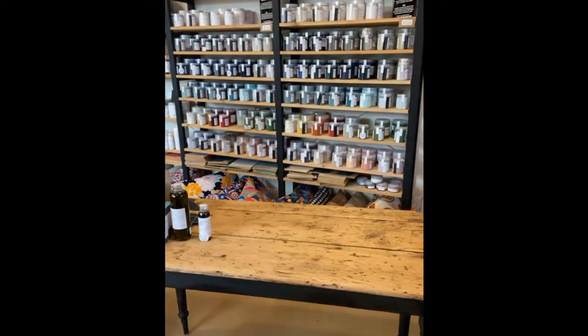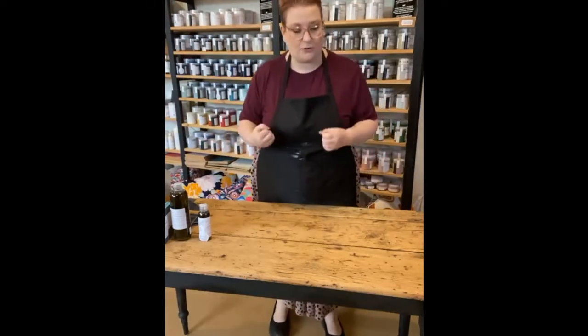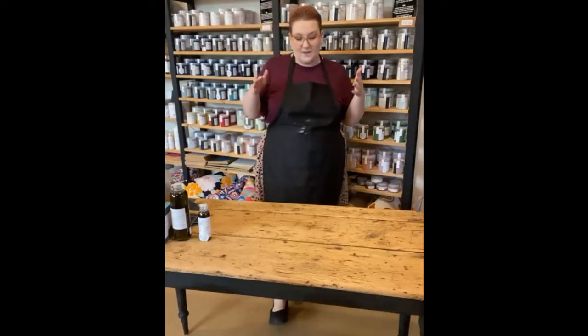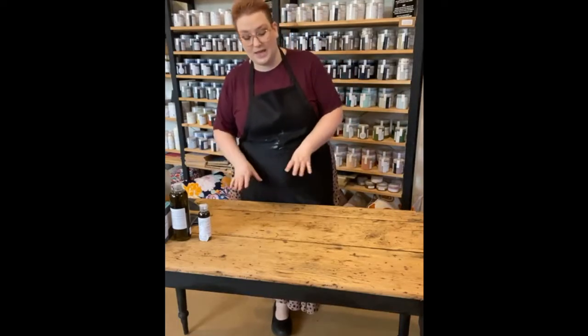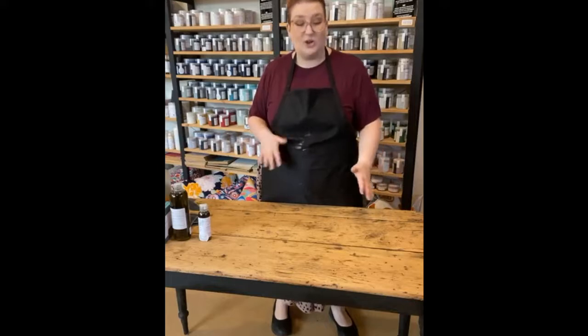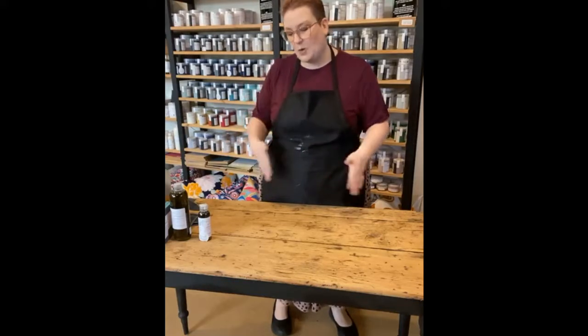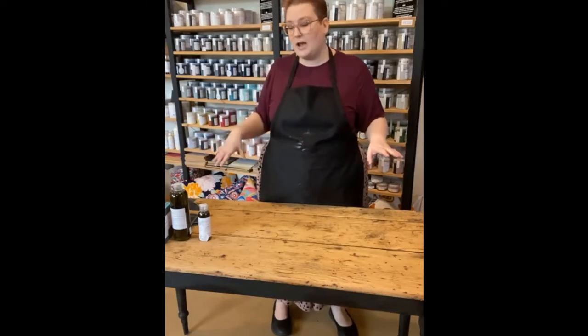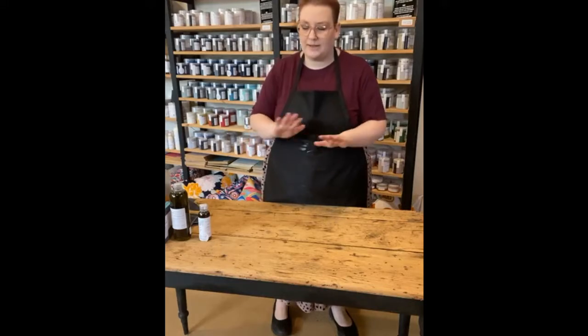With this piece, we're all about preserving the history of it. I don't want to lose this patina — it's beautiful, it's rustic, and it tells a story. And that's why we're coming in with the hemp finishing oil. In preparation, other than filling the holes, I gave it a really good clean yesterday with some hot soapy water, just enough to get any dirt and muck — it was a bit grimy. I've then allowed it to dry overnight to make sure it's 100% dry. Sometimes when timber's quite old, any sort of liquid, it's going to suck it in and a lot.